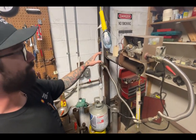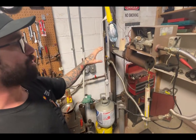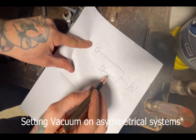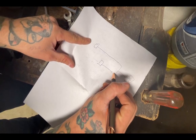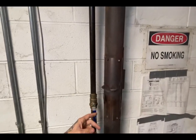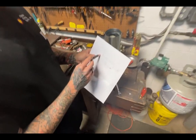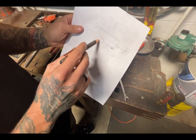After you've gone through and checked your filters and your vacuum, if you still need to make an adjustment on the damper, the damper is located on the inlet plate to the vacuum pump. If you have a longer leg and a shorter leg and you're testing vacuum on each leg, the shorter leg will be pulling more vacuum. There should be inline somewhere a damper coupler. The order of operation is: set your vacuum on the longer leg at the vacuum pump, then dial this vacuum pressure down to make your shorter leg the correct pressure.